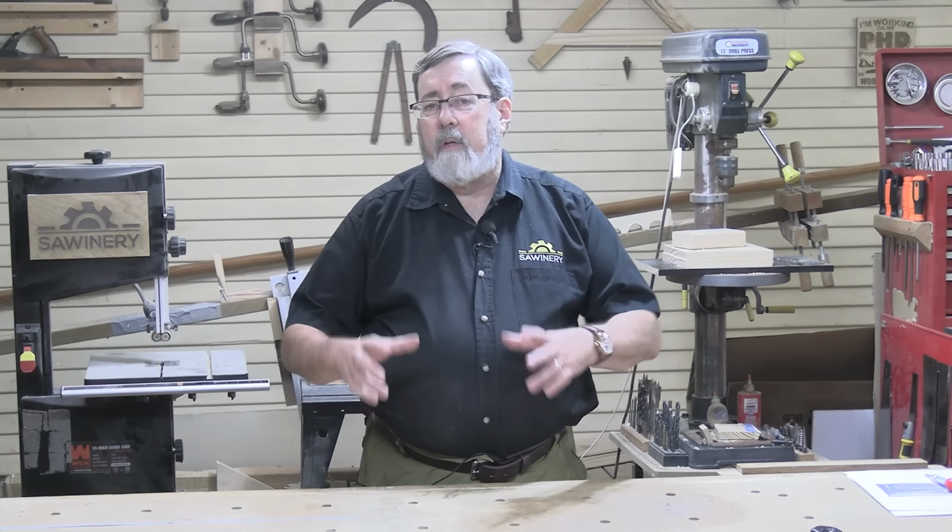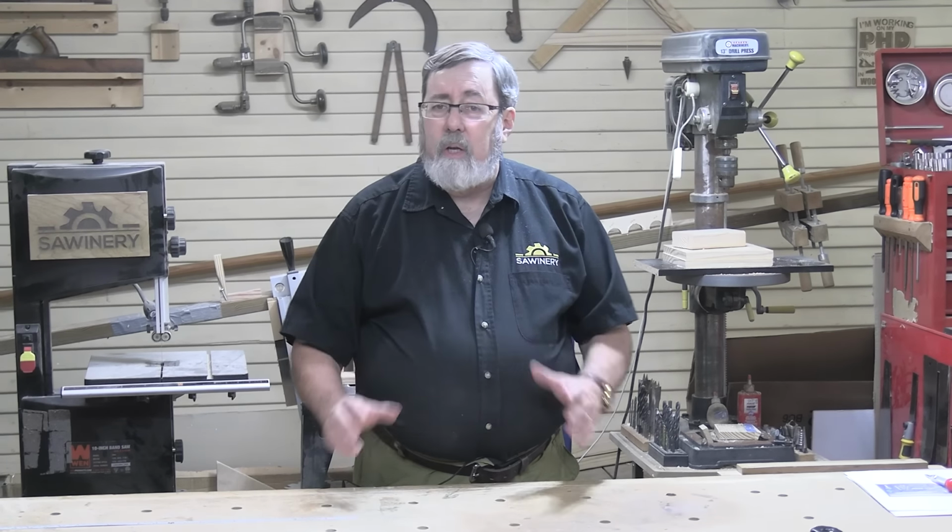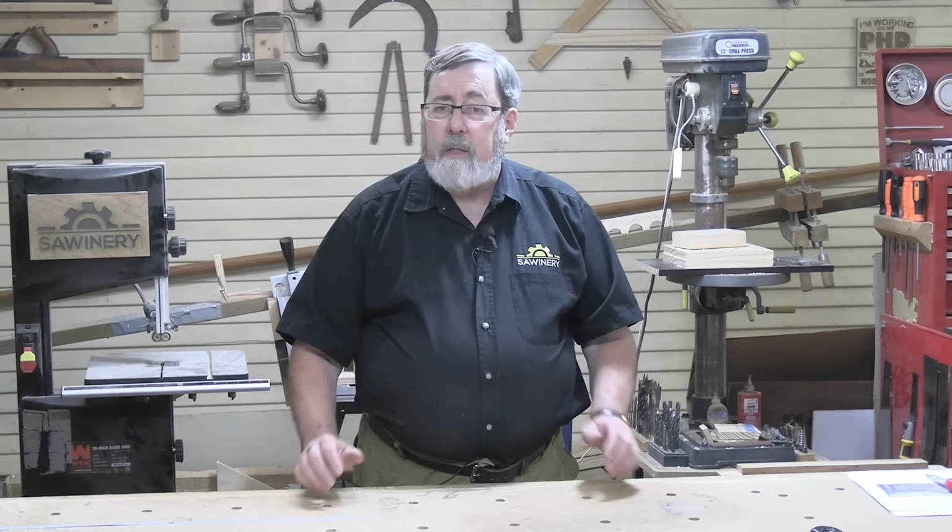Now, some people think you need the domino joinery because of strength, and that's really not the idea, because gluing 2 pieces of wood together is as strong as you need to get. Putting those little wood dominoes in there really doesn't make it any stronger. So if you've heard anyone talk about, well, you've got to have it or you can't make a strong tabletop or a strong joint or whatever, they're wrong. What it's really about is alignment.